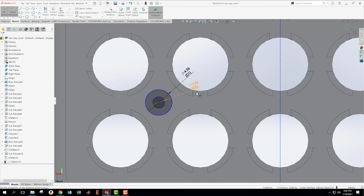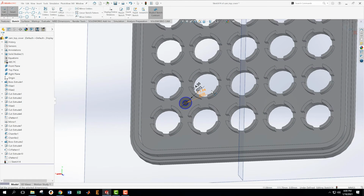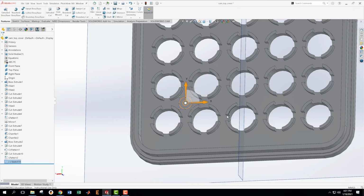And in detail Y, you can see on that drawing there is a 13x diameter 1.94 with a line and an arrow pointing down 2.9. That is how deep I would drill a hole if I was going to drill a hole. But I just checked in the other section, just so you know what I'm talking about here, that was section AE, that those are the same. And that's the number that I wrote down, 5.3 minus 2.4. So that would be the same as the dimension we just saw. So I'm going to accept this.